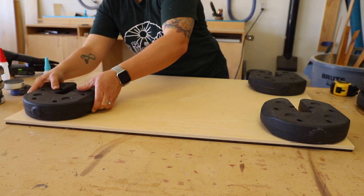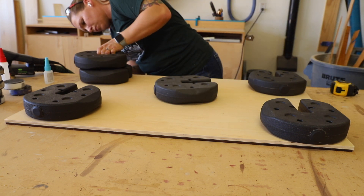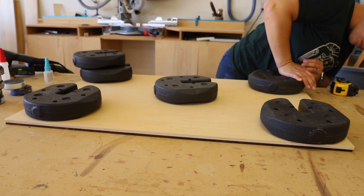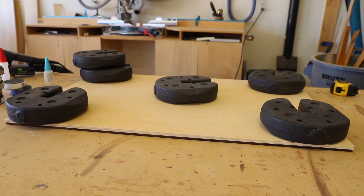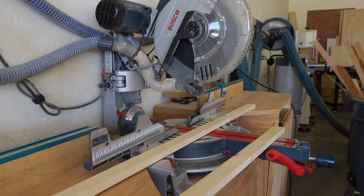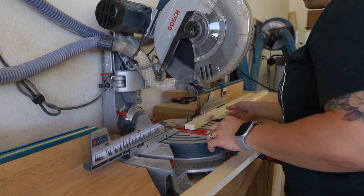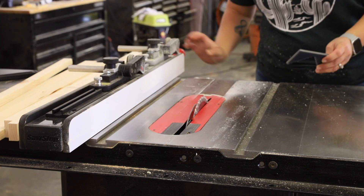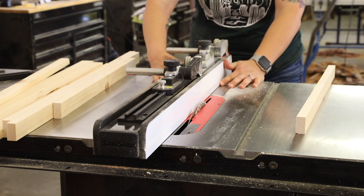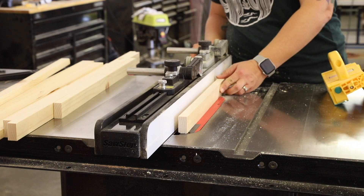Because this piece of plywood was also just a tiny bit warped, I used weights on the corners and in the middle to make sure everything sat completely flat onto the mirror backs. I used 1x2 pine for the frame and cut it down a couple inches longer than I needed. Back at my table saw, I set it up to cut a rabbet into the 1x2 boards. I set the blade height to the thickness of the mirror panel — 5/8 inch thick — and set the fence at 1/4 inch, then ran all the edges of the 1x2s through the saw for the first cut.